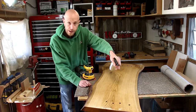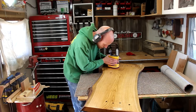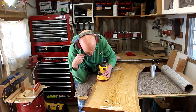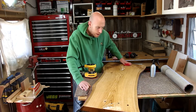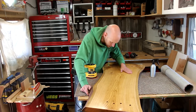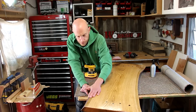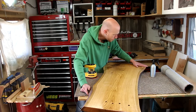We'll just spray it down again and keep sanding. Make sure you keep moving — you don't have to go super fast, but definitely don't stay in the same place for too long. If you just sand away for a long time, you could very well sand through the clear and into your wood. Now I can really start to see the high spots and the low spots. If I run my hand across it, the number of little points of dirt or whatever in the finish is significantly less than when I started. I still feel some little bumps around this edge right here — I know I need to hit that a little bit more, pretty much all the way around that edge.